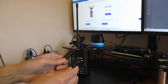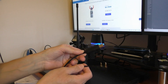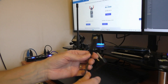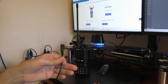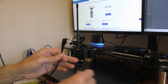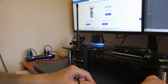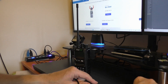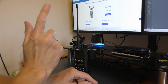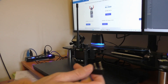The first thing you're going to need is a generic two-pin Kenwood-style programming cable. This is a very cheap one I picked up on eBay — it works with Baofeng radios and doesn't need a driver installed on Windows as it uses a Prolific driver that comes with Windows 11. When you plug this into the computer, listen for that familiar Windows sound confirming the driver is ready to use.